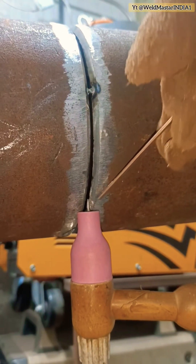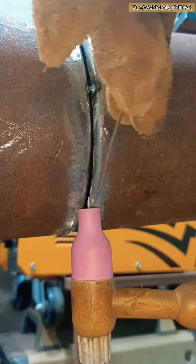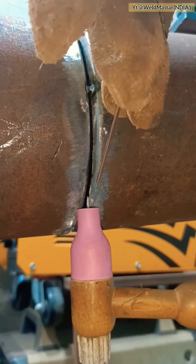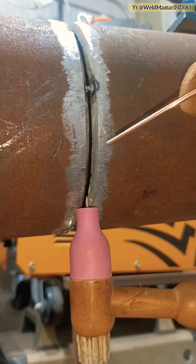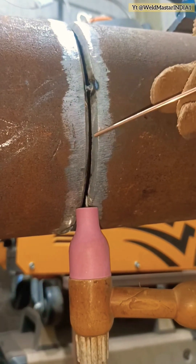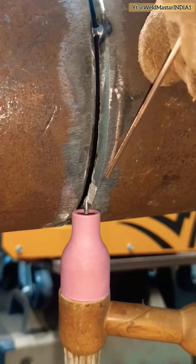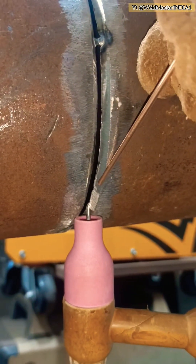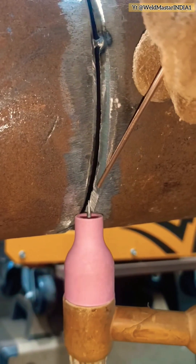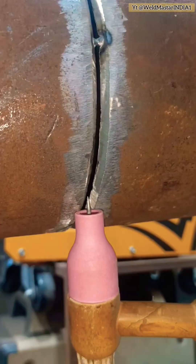The tungsten needs to be extended further and sharpened to a fine point. During welding, press the tungsten deep to the root of the joint. After tying in the filler, keep feeding wire from the outside and push it into the root. This produces penetration, though not always uniform, but at least it guarantees the joint is fused through. Because the gap is small, the molten ball of filler will be relatively large, so you must use sufficient heat to drive the filler all the way into the root.